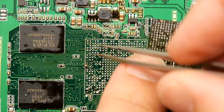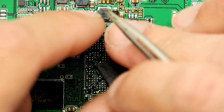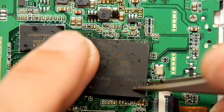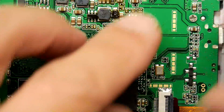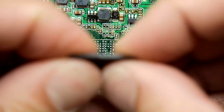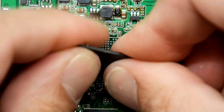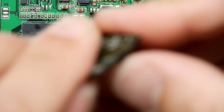If you're going to try to solder BGA chips by hand you need a lot of equipment, because you have to make sure that each one of those microscopic balls of solder is melted and adhering to the PCB well. That's going to be absolutely bonkers to try to do by hand, but people do do it — they use ovens and all sorts of tricks. I've heard some people actually use an iron and put the whole PCB on it. In terms of flexibility this seems a lot less flexible now, but I'm going to have a go and see if we can crack it and get to the innards inside.